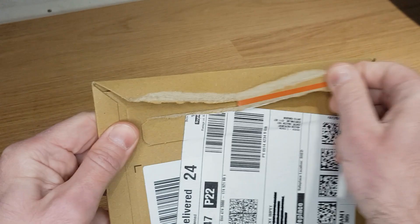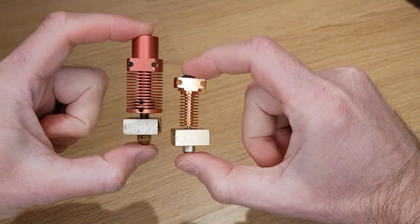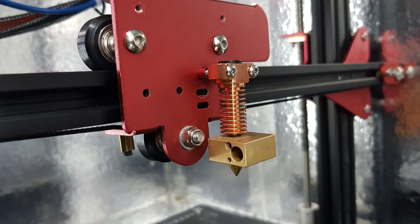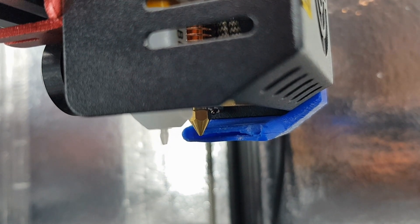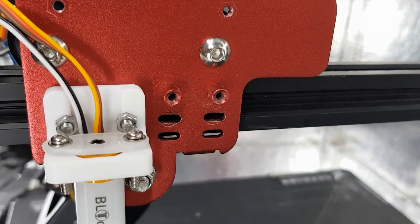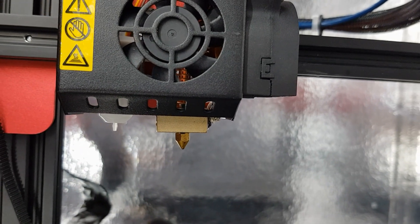Sure enough the next day my package arrived and I had to start figuring out what I had to do to make it work. The new hotend is about 15mm shorter than the old one and comes with a heat block and a stainless steel nozzle, which I promptly removed and replaced with a brass one. If I were to just bolt this assembly in then the nozzle wouldn't stick out the bottom of the fan shroud, the cooling fans would all be pointing in the wrong place, and my BL Touch probe would be far too low compared to the nozzle. There are some slots a little further down on the X carriage that I could use, but this would put the nozzle a little bit lower than the original hotend, meaning I would have similar problems but maybe a little bit easier to overcome.